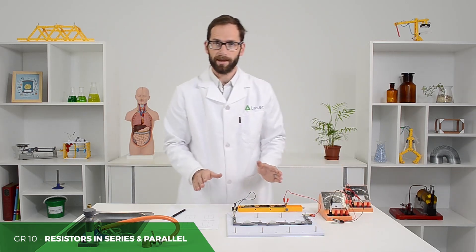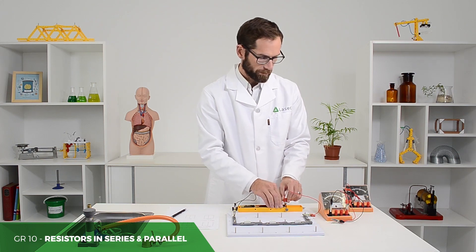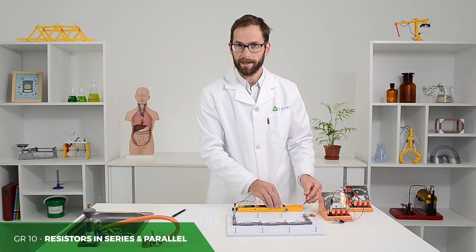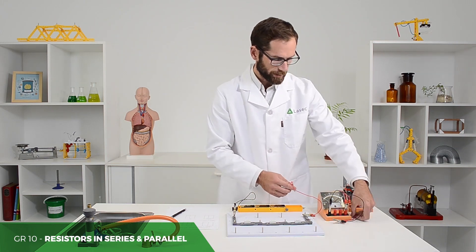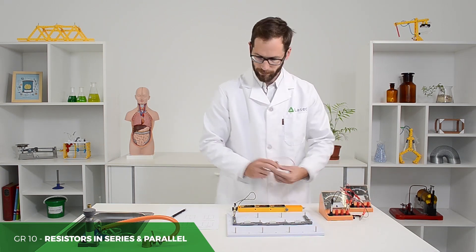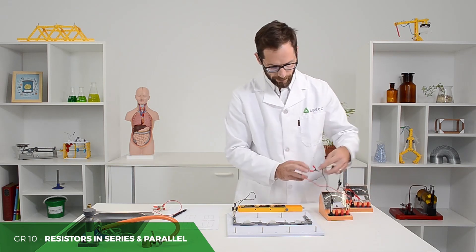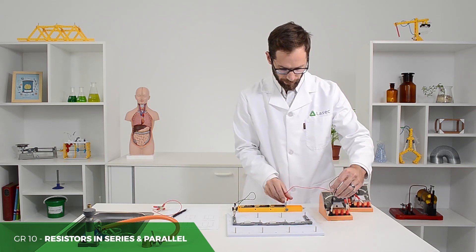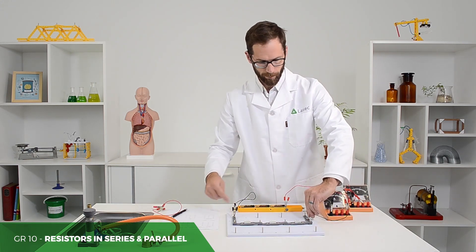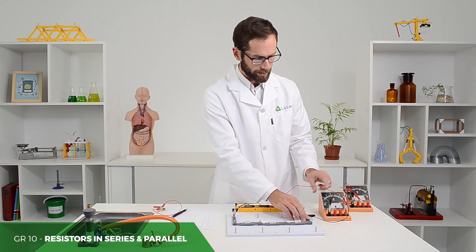When they're taking their current readings, we're not going to do that in parallel but rather in series, so we actually have to break the circuit where we are taking that reading. For example here, keeping the polarity correct — if I remove that lead, then positive to positive, and then negative to this part of the circuit which is connected closer to the negative terminal.